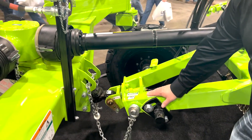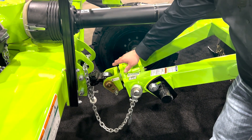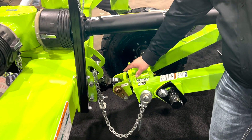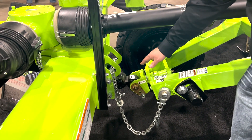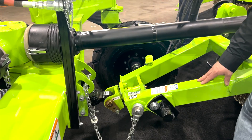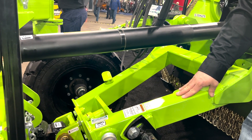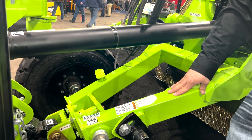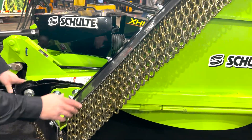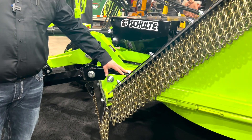There are a few different hitch options on the Series 5. This is your standard swivel clevis connected to a FLX 1510 flex arm. There are other options including an open clevis, adjustable clevis, precision hitch, or the pro level hitch. CV hitch can be optioned in 540 RPM or 1000 RPM. There is also in 2024 an equal angle hitch at 540 RPM. Front and rear belting is also an option, as well as an optional flex arm mount if being paired to an FLX 1510.